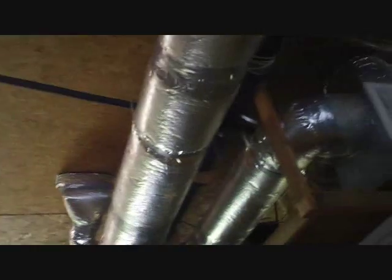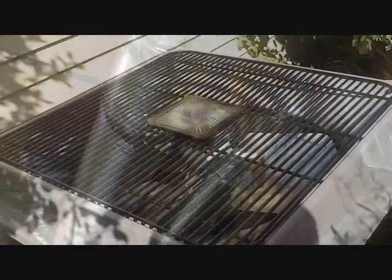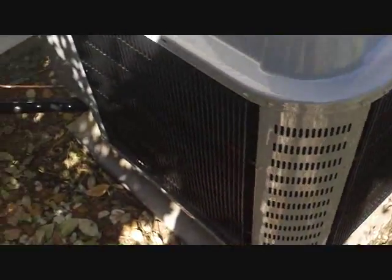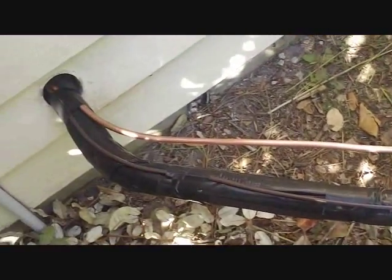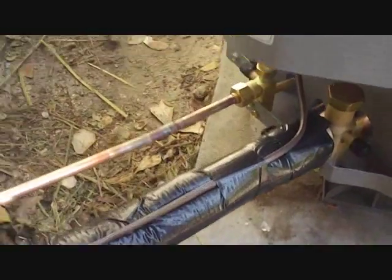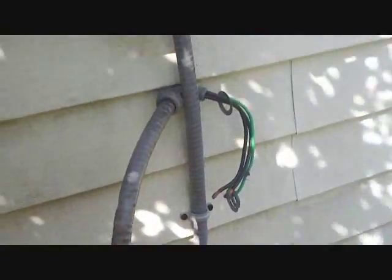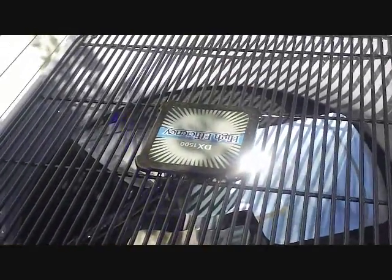What we're doing is running the line set up and over to the unit location. I've already set the condenser outside. We've got another 15-series heat pump sitting out here, with the lines running through the wall. The suction line is running all the way back to the air handler but it's not tied in yet. Liquid line is tied in here. Got the low voltage done, but I might have to go get a new whip because this one isn't long enough.